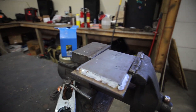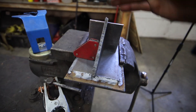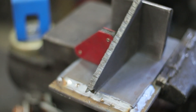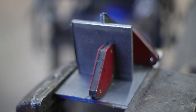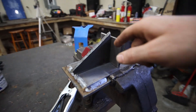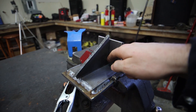You're trying to teach yourself the hand position, how to be comfortable while you're welding, and what the machine should sound like. That's the goal of doing these plate-on-plate exercises. You can just keep stacking plates until you feel comfortable. Then the next thing we're going to do is weld a 90-degree joint — stick a piece like this to another piece of material. This is where your magnets are going to come in handy. I have basically a gusset holding that up, and then a magnet here and a magnet on the backside. This gives us a bunch of different angles and challenges to weld, and this setup is what I actually recommend you practice on the most.